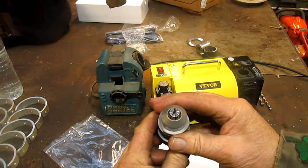Okay, put this back. Bring it down till it's tight and then come back, well, maybe not even a quarter turn. Just enough so it can slide. And then this is, what's the size of this one? 3. So bring this down to 3. Bring this in, push it in until it gets all the way up against. There it is, right there.